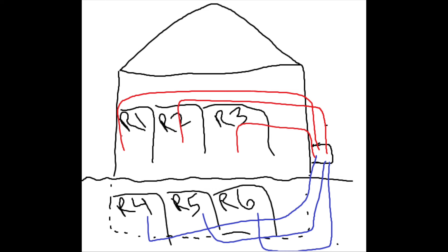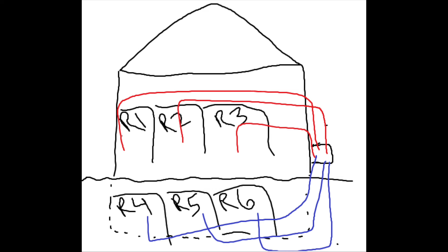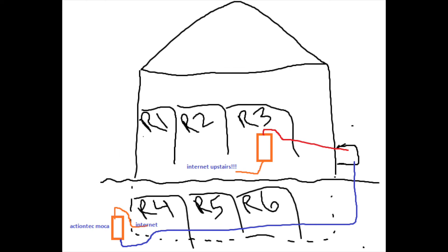For the ease of this diagram, let's focus on wanting to connect room three and four together. You can see that we have a standard coax TV jack in each room. Our network signal is originating from the basement and we don't have Ethernet upstairs, so that's what we're going to achieve with the ActionTech MoCA adapter. These adapters are all the same — you can flip-flop the adapters because one is not specifically built to be only on the originating Ethernet end where the Internet is. We will place one ActionTech downstairs, plug it into the coax jack, and also plug the Ethernet cable into the network switch downstairs. Think of this as injecting Internet into the coax cable.